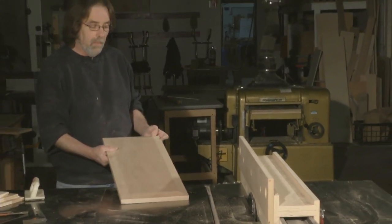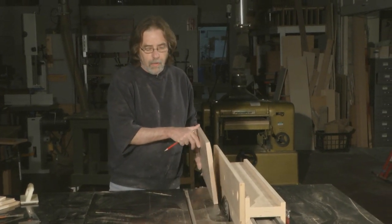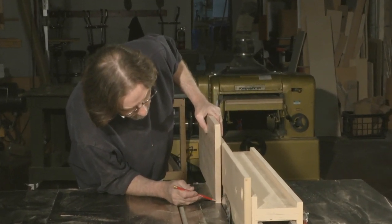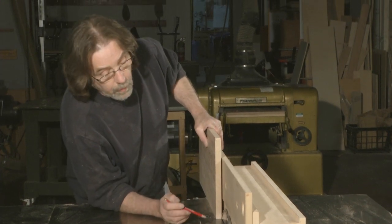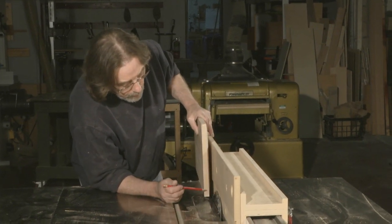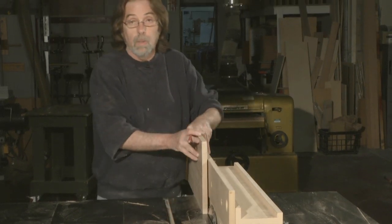The other thing is it's safer and I'm not limited by the size of the wood. I could also come down to a knife point if I needed to, very safely. The main thing is that this rabbet has to be here so that your offcut cannot be trapped, because that will kick back.